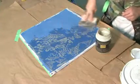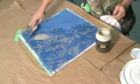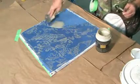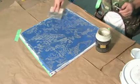When perfecting the top coat application, the method will eventually involve applying top coat in big sweeping strokes. Be sure to check your blade edge for dry top coat to avoid dry bits streaking the surface. Once the entire surface has been top coated, you may begin the final top coat application.